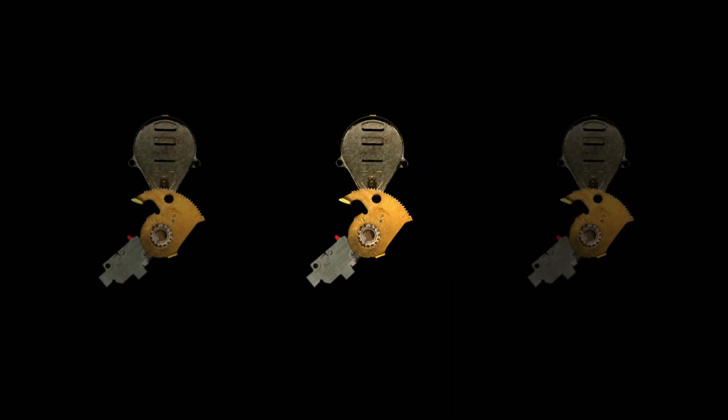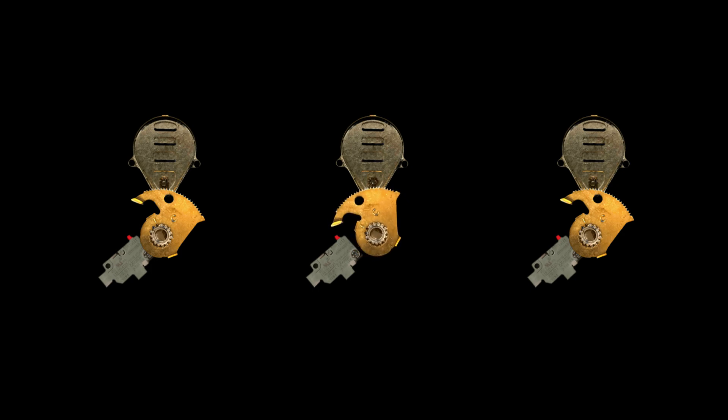Let's cover the end switch wiring. These end switches are kind of like the thermostat of the burner circuit. When our zone valve motor activates and that gear pushes in the little button on the end switch, it closes the switch for that circuit and the burner circuit for the boiler can be activated, allowing the boiler to go through its startup sequence. Any one of these switches can turn the boiler on — we don't need all three, we just need one. And as long as any one of these end switches is pushed in, the boiler will continue running even if the others shut off. The 24 volts that runs through these end switches is not the same 24 volts from the transformer we've been talking about — this is a separate power source, and that's why we have zone valves, because we don't want to cross these two circuits over one another.